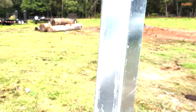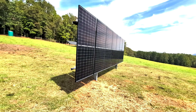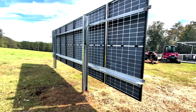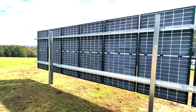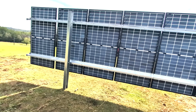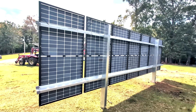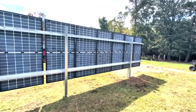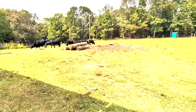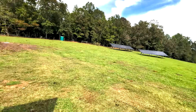The vertical solar fence prototype is up. 'Prototype' meaning I'm using standard Sinclair ground-mount material — didn't change anything, just removed the trusses and struts, so all I had to do in the Sinclair was drill four holes in the C-channel. I could add a strong back but I don't think I need it. There are a couple of different ways to wire the back. This is the back side where you see the steel and the wiring, so you'd want to position the fence with that side facing away.